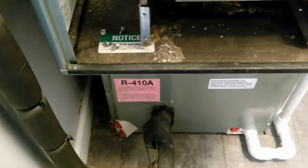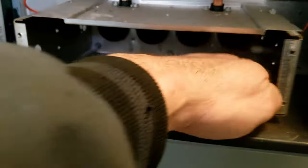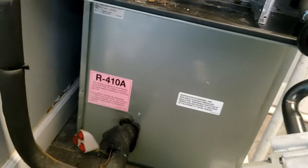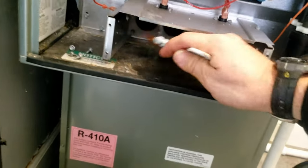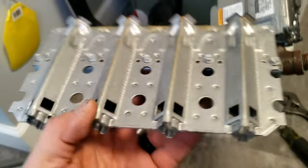Basically what we've done so far is checked the orifices here, and then we'll go ahead and wipe some of this other stuff out — it could have been any of this stuff that caused the issue. We'll go ahead and get a little of that out because it's very hard to get out of there, and those burners are in place — not as creative as Lennox is on theirs.